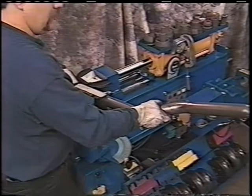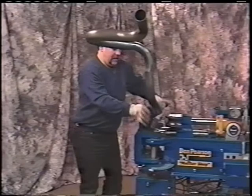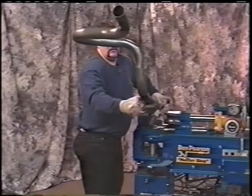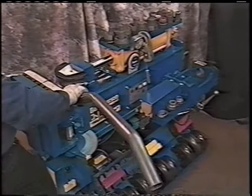We'll come back in, and how do you check the pipe at the bender? We'll go ahead and set that here level. What we need to do then on a Ford, because the tire comes in so close, this will be our last adjustment bend on the Ford. We want to come approximately into here, tight in with a die. We're going to put a bend that brings this back tailpipe to the outward side.